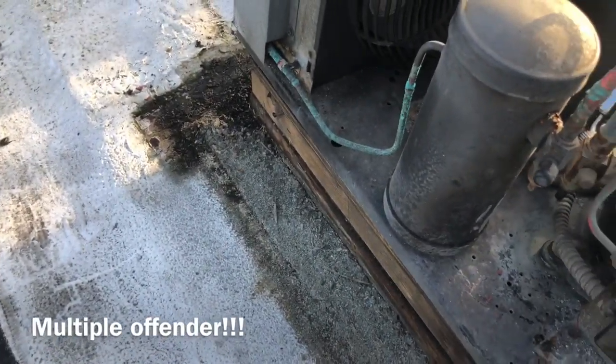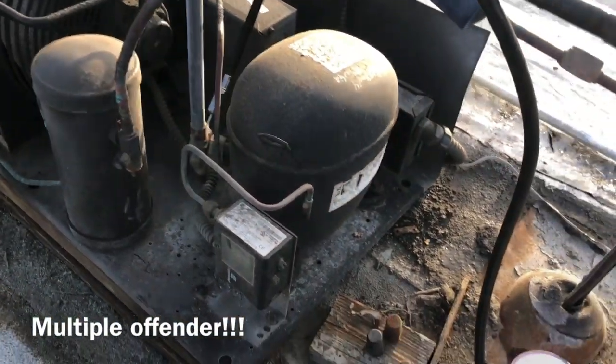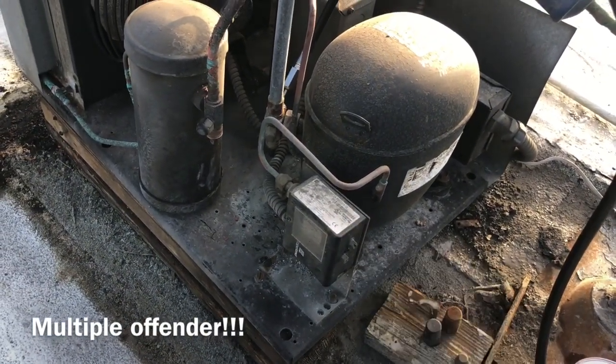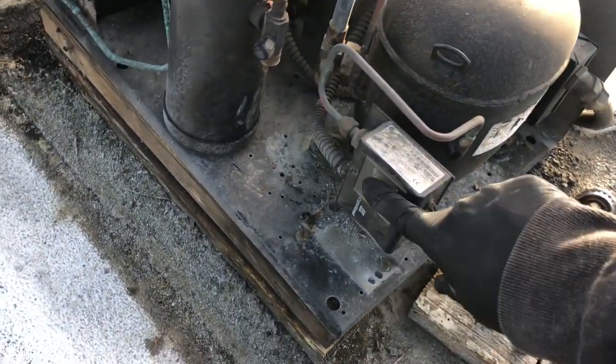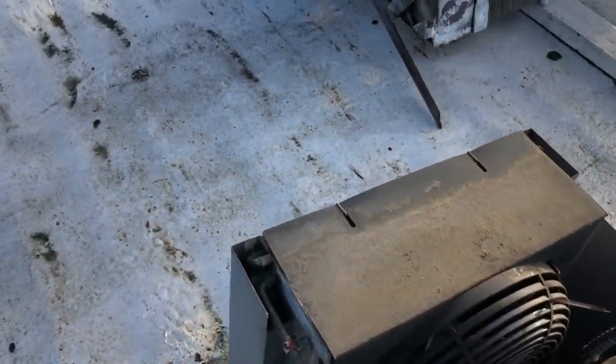There's always a multiple offender on every job — I told you guys that from the beginning of my videos. So when this thing was up here running just now, the solenoid was shut off, and this suction pressure switch — I had to wrap on it to get it to turn off. We should be able to check that right now too. Let's go pump this thing down.